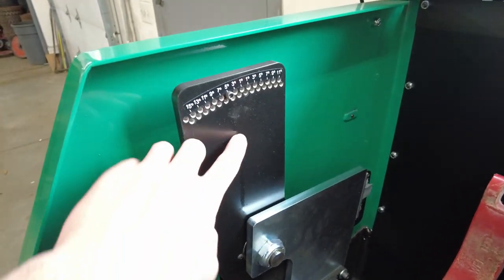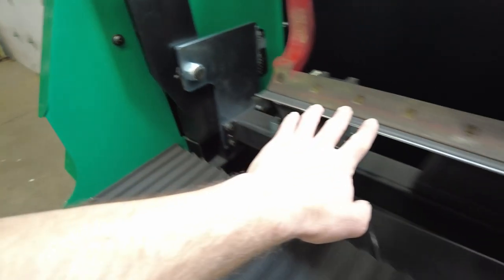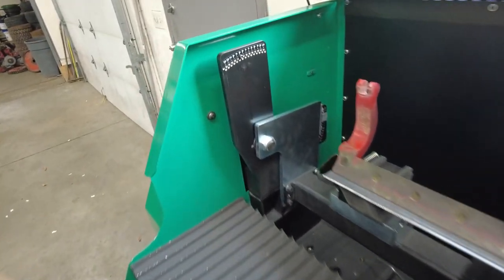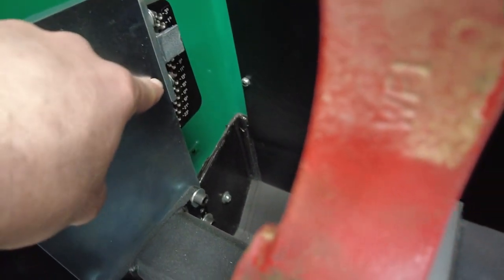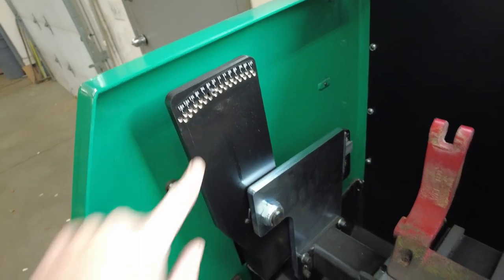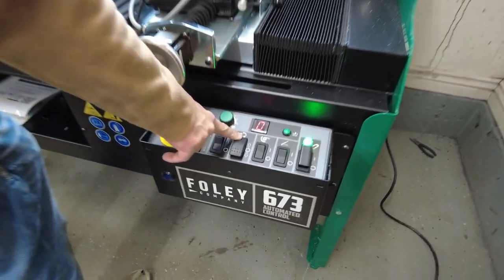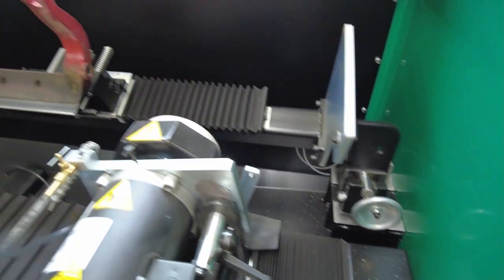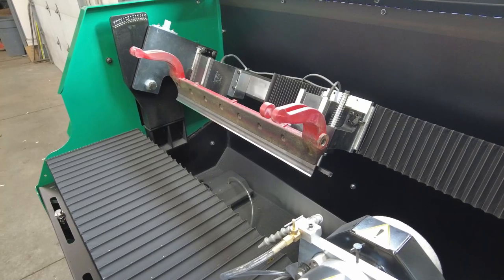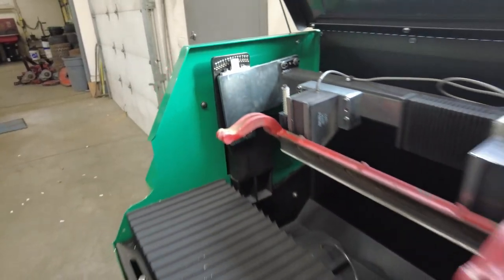On this machine there's a little stop screw that sets in here, and this plate — this whole mounting assembly — rotates up or down depending on what part of the bed knife we're doing. There's a stop on the side; the angles are pre-calculated. The stop up here, the angles are all pre-calculated. Then show us how this flips up, Mr. Crowley. There's a switch here he's pushing, and then this automatically rotates itself up so we can do the front face of the bed knife. You'll watch it just hit against the stop — we know it's right at five degrees.